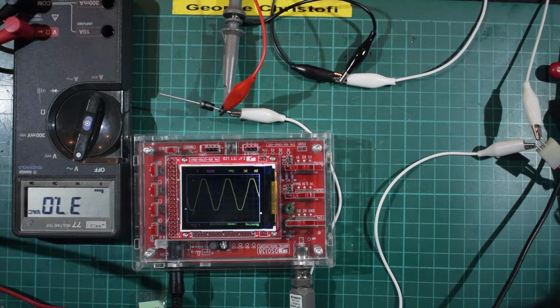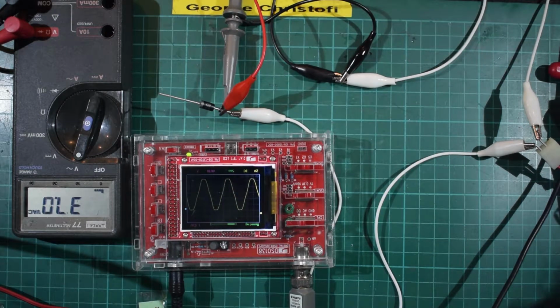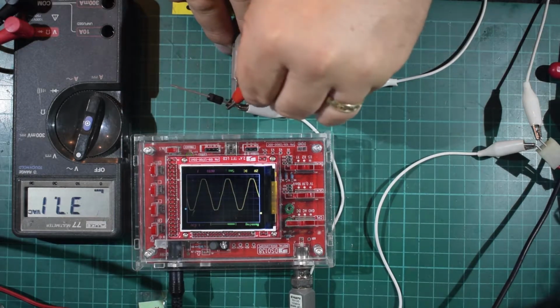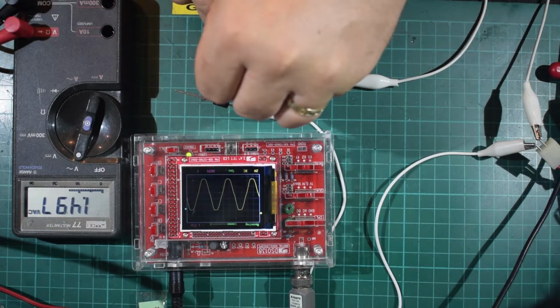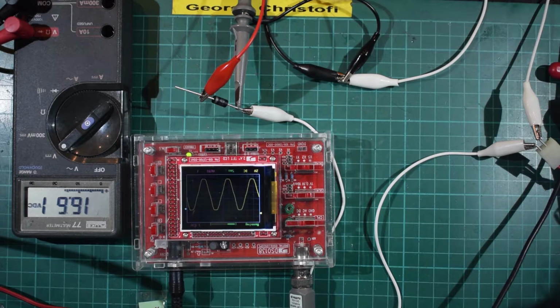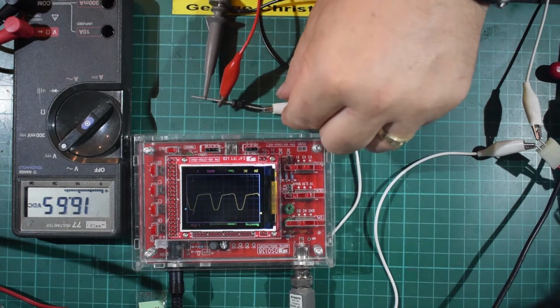So what we've done, as I say, we're just measuring there. Now, to change to DC, we need to do what's called rectification, which means it rectifies it from a swinging signal to a not swinging signal, or one that swings a lot less. And the way we do that is with a diode. So I'm just going to take that off there and connect it this side, and flick that to DC, and then I'm going to take off the scope probe and show you what's happening the other side of the diode.